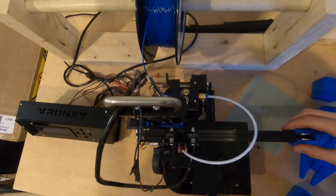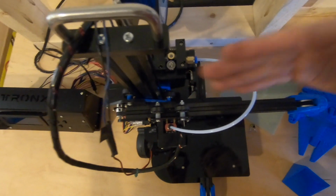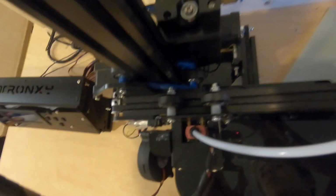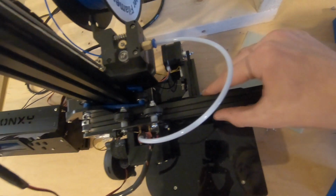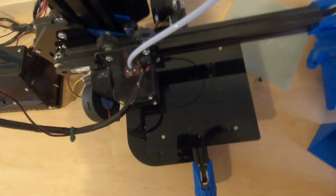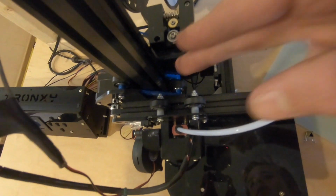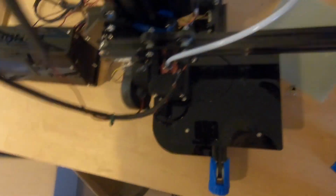See, this is a cantilever style printer, or cantilever, whatever you want to call it. So everything has to be perpendicular, or else there's going to be problems. So when I installed these things, they were a little bit warped, and I actually had to use a hairdryer to heat them up, so I could change them around. And it must have not been even, because these were causing the x-axis to go this way or this way. I forgot which one, but it was causing the prints, when they're supposed to be circular, to be oval. So to fix that, I just put the heat gun back on it, and once they were hot, I just pushed this over, and it corrected itself. Well, it didn't correct itself, but I had to hold it in the perfect 90 degrees, and then once it cooled, it was perfect. So that's the first issue.